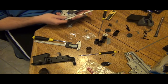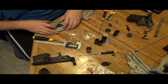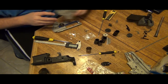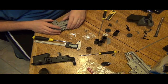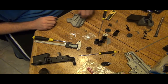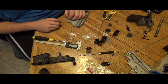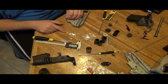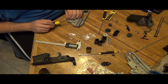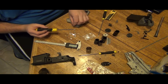I don't want to lose any shims here. So this is upside down. And even upside down, we see that there's a very tiny gap. So it's like 0.1 millimeter. Visually, I can see that little tiny gap. Once you do this more often, you can actually tell. I don't know, some people can't, but I can actually tell what size the shims are. I won't be 100% correct every single time, but very close to correct every single time.